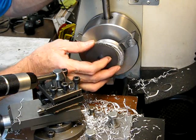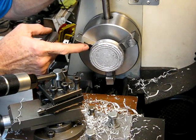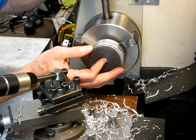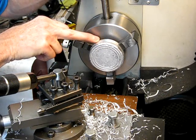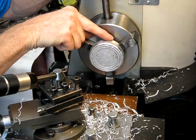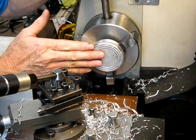Basically machine it to the diameter you want, then machine it back to the thickness of the gear you want. You'll essentially waste all the aluminium you don't need. You get that as your working surface, turn it around, mount it so that it's only mounted in the thickness of the gear, and then machine away all the stuff you don't want.